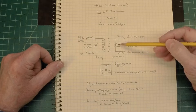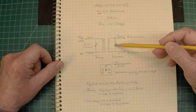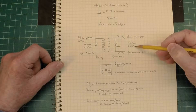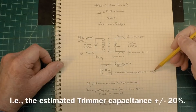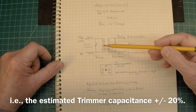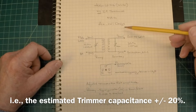I did not take time to disconnect the lead wires from the inductor itself. I just didn't want to take any chances of doing any damage or come up short on the magnet wire that was used. So if you reverse engineer the inductance value here, I come up with 113 picofarads — roughly just north of 100 picofarads — to make the coils themselves, primary and secondary, resonate at 465 kilocycles or kilohertz.